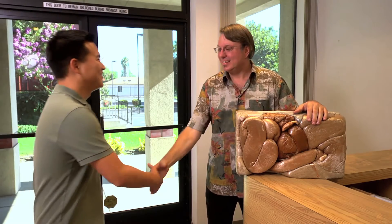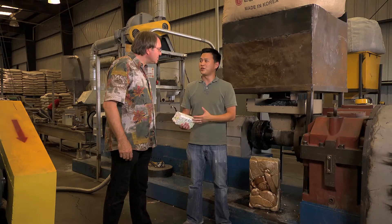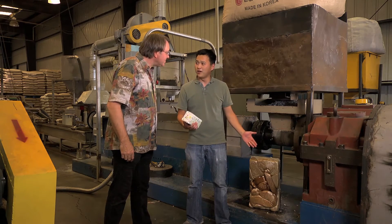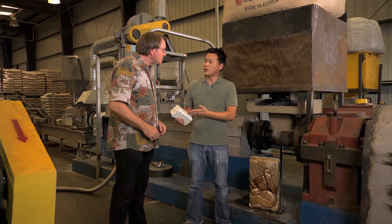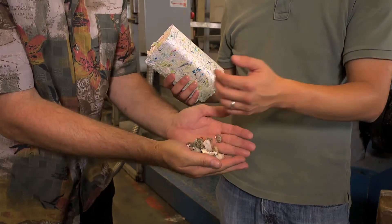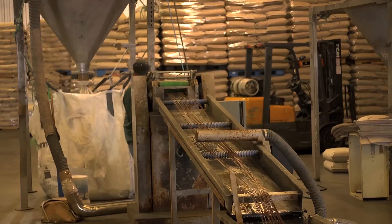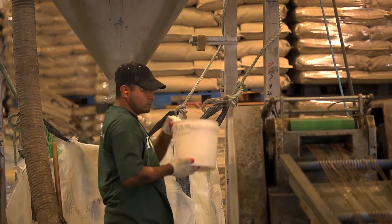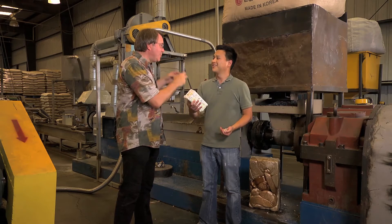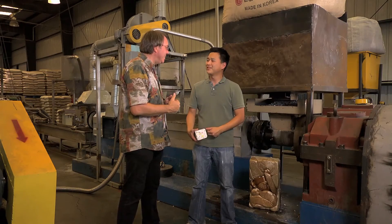I'm Jonathan Lee. I'm hoping you can help me learn how this can be recycled into something new. Absolutely, come with me. The first part of the process: we take blocks like the one you brought in, along with blocks we get from MRFs and other suppliers, and they get broken down into smaller fragments. These get broken down further in our pellet machine, stretched out into spaghetti-like strands, then cut down into pellets. What do you do with the pellets? We extrude them into picture frame moldings — the pellets are used as feedstock to produce your frames.